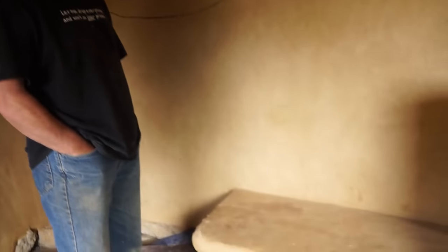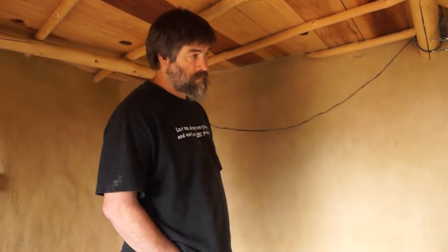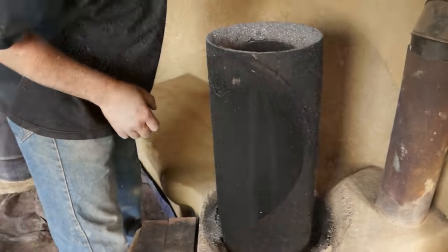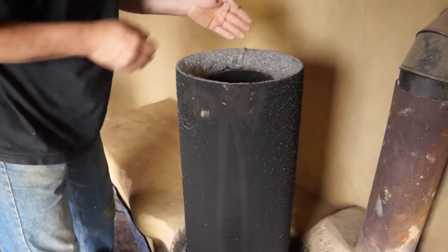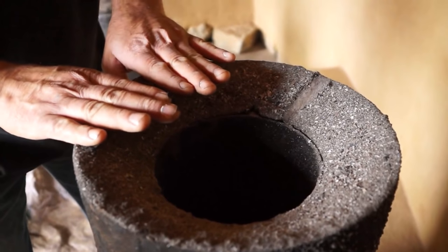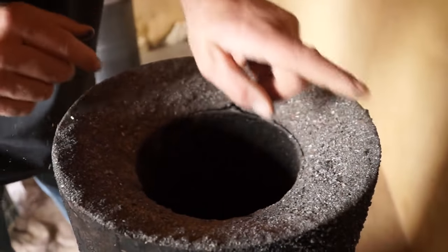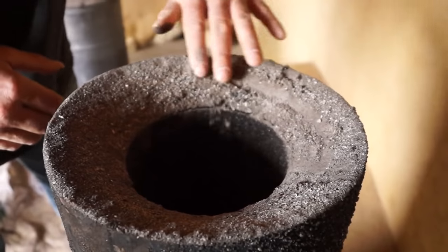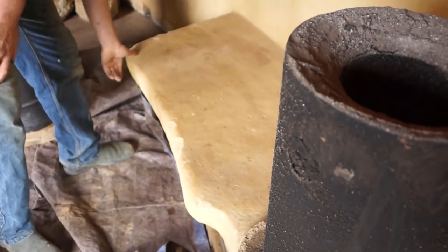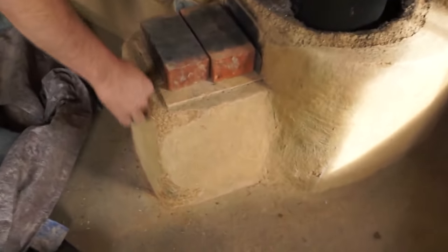It's been around here in use off and on, mostly in the winter time for five years. The barrel is loose. It's doing the usual ash buildup thing, but because this is tapered, it can't really build up very thick. I've seen with a flat top on a rocket stove it'll build up so thick that it'll pinch the barrel off, pinch the flow. So the ash can't really stop up here. There's a little bit of ash, not very much. Protruding corners always get whacked. This stove's seen a lot of use, a lot of contact, a lot of human contact. The plaster's off.